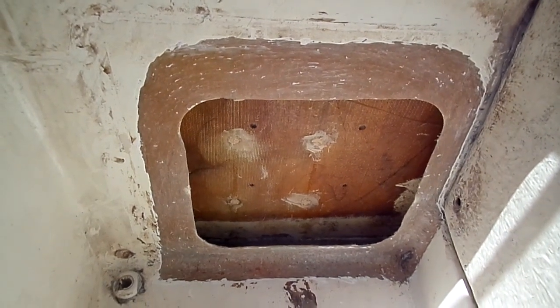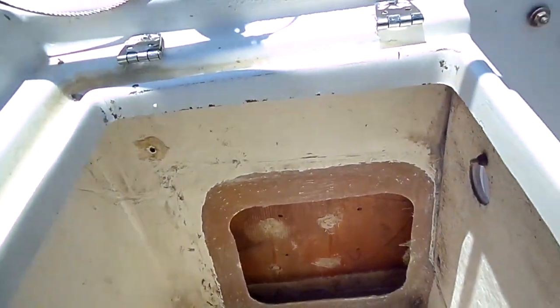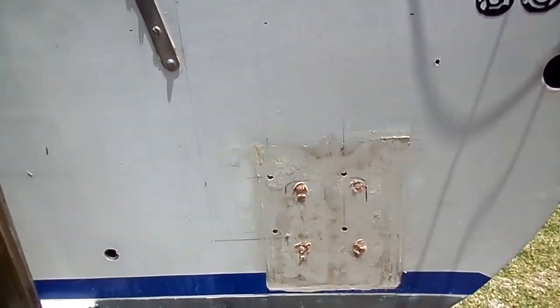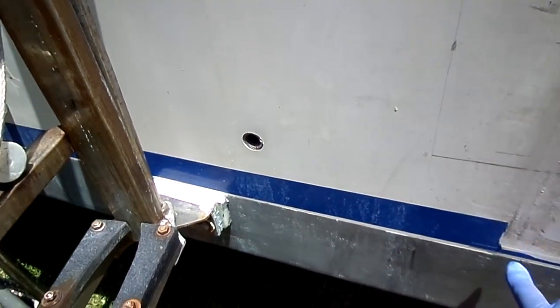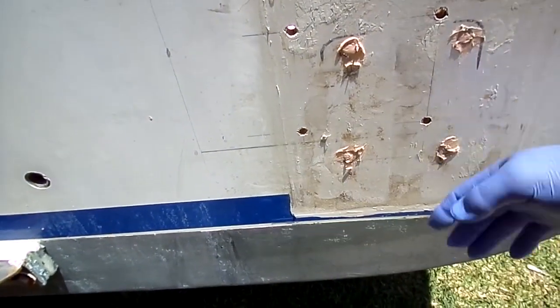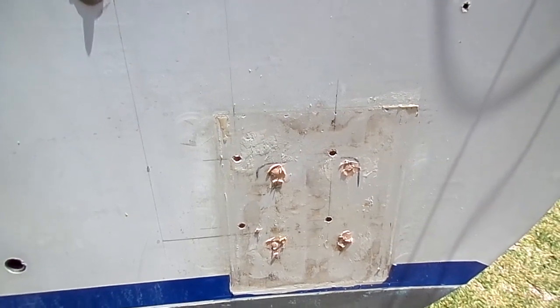Now I'm going to round to the outside of the boat and have a look at grinding down the gel coat and think about putting some extra glass on there as well. I'll run a patch around here — probably about another four or five millimetres of glass. I'll come right up because there's timber behind this part of the transom. Hopefully it'll stitch off that and come all the way down, tying in with the bottom of the cabin bunk inside, so there'll be a continuous bracing in there. Time to get some grinding done, then we'll get on to some glassing.